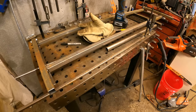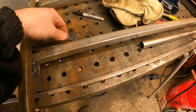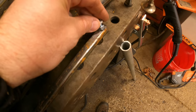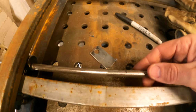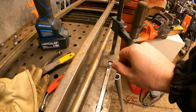I only had a minimum amount of rod around here, not enough to travel from this side to that side. I had this small square tubing and it just so happens the rod fits perfectly inside it. This is the scrap stuff I had. I drilled a hole on the end of it and I'm going to weld a little nut on there — the bolt's going to be a lock bolt for it. The rod is going to go in here and that's going to be kind of like a set screw to lock it on. This is going to allow me to time this cam with that cam, so you don't have to get it right the first time when you weld everything. Even if it's off a little bit, you can loosen up the bolt, adjust it on that rod and it will be in time.